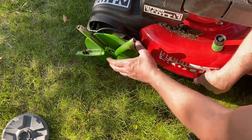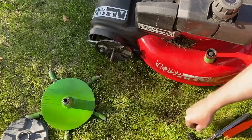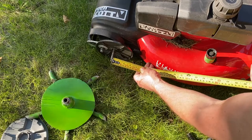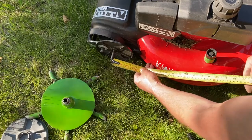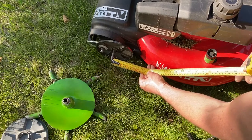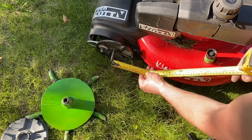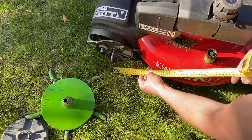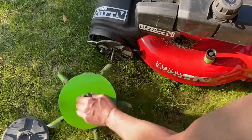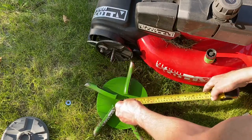You can see here you've got about an inch to play with. The best way to measure on an 8-inch wheel is to measure from the axle center at the edge or base of where the threads would stop, against the face of the axle. You can see here that you've got six inches of clearance from the shroud where my fingers are. You know then that the aeration wheel is going to fit, because the radius is six inches.